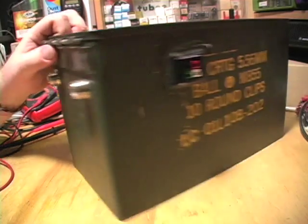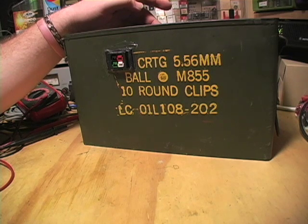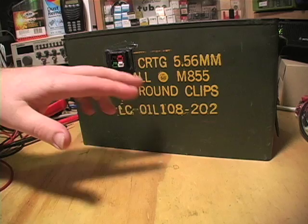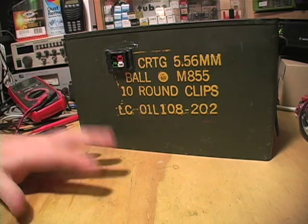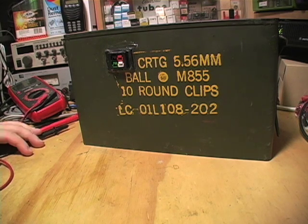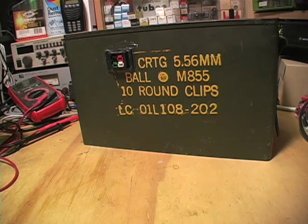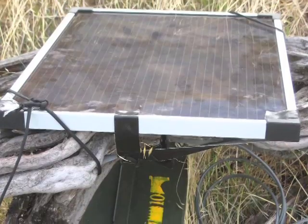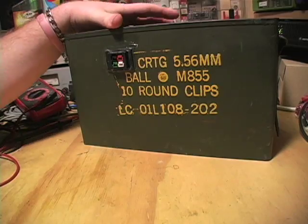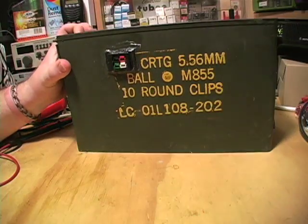This should be pretty much everything you need to build one of these. I also put some desiccant in there and sealed everything with RTV — stuff that costs nickels and cents. So all together with the radios, the ammo can, and all that stuff, you're talking maybe $100. The other thing comes down to charging — how do you charge this thing? I got a five watt solar panel from Harbor Freight, bought it about five years ago for maybe $20 to $30. You can literally put an Anderson PowerPole connector on it and plug it straight in. You don't need a charge circuit since it's only five watts. On this hunting trip we ran about a week, doing all our comms through here at two watts, with a five watt solar charge circuit and one single seven amp hour gel cell. It ran fine.